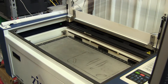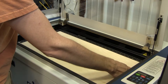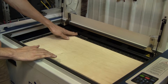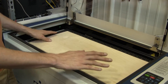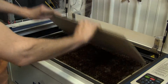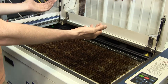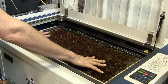If you've been engraving something on the table and the table's up high, and you go to put the vector table in, you'll see that the vector table will collide with the gantry if the gantry tries to move. You can't focus or move the table up or down with the vector table in place, because when you try to move the table up or down, it thinks you're trying to focus, so the gantry moves out and is going to hit the table and collide with it.